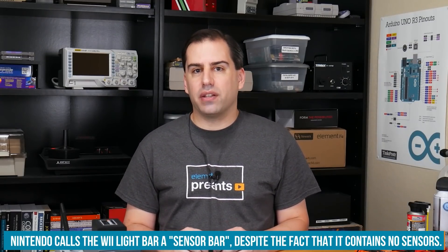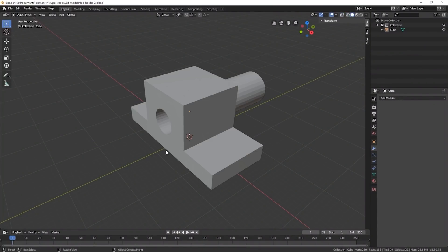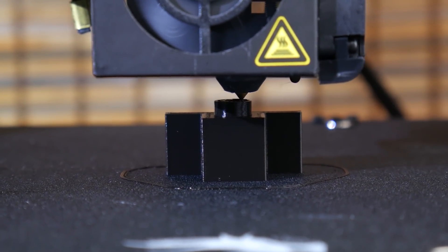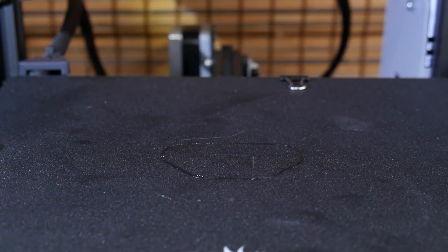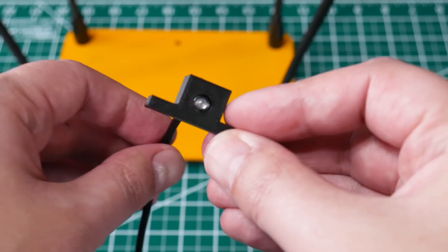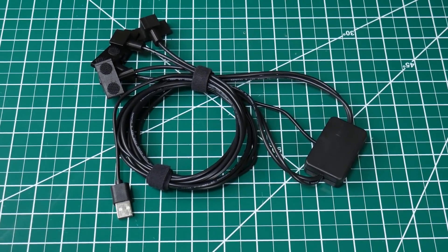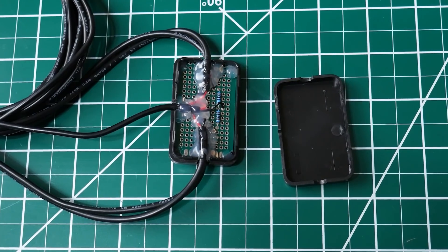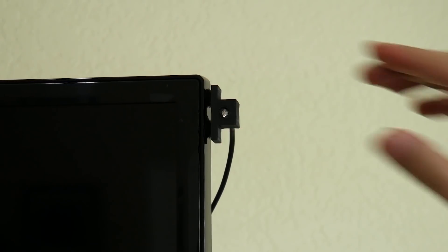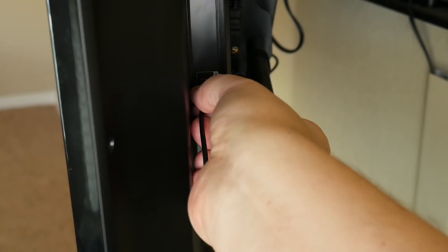I really liked the idea of not having to use a light bar, but it didn't work out in practice, so we'll go ahead and use LEDs on the TV itself. We'll put one LED on each corner, just like we did with the tape, and that will simplify our tracking software even more. Over in Blender, I've designed an LED holder and will print four of them in black PLA. We can power these off USB since most TVs have USB ports available. I've wired it up on some protoboard and put it in a plastic enclosure that snaps shut, with Velcro dots for a removable mounting solution.